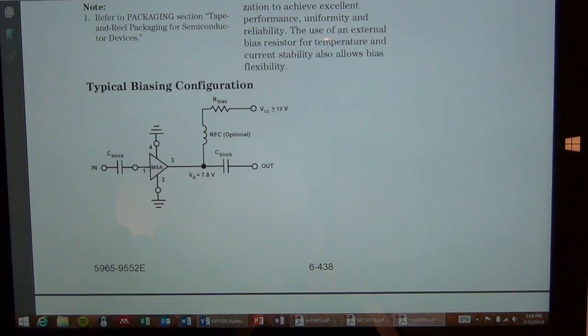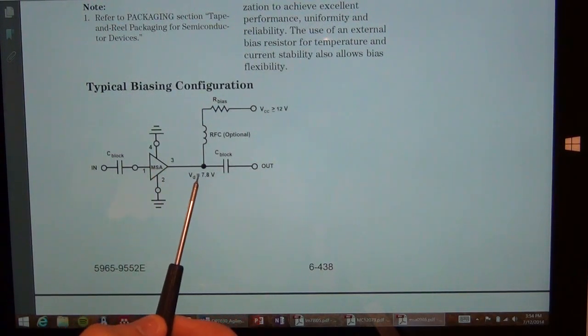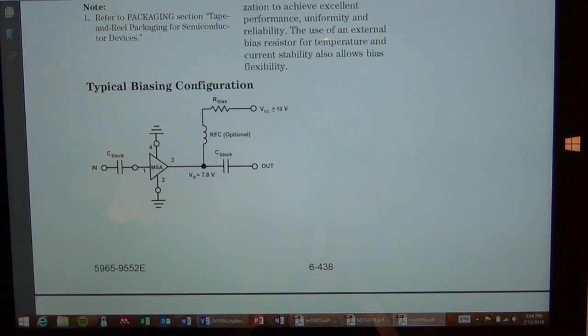This is a very typical thing to do. In fact, if you remember, I did a microwave tutorial video before where I showed you what a bias T looks like. This is essentially a bias T, enabling an RF signal to go this way and a DC signal to go that way and keep them completely separate from each other. A bias T is not supposed to contribute to the output impedance or the input impedance of the amplifier. It's supposed to be short and open for the frequencies that you want it to be.